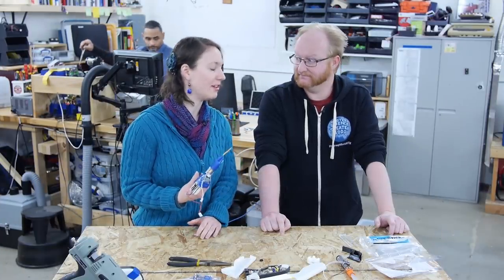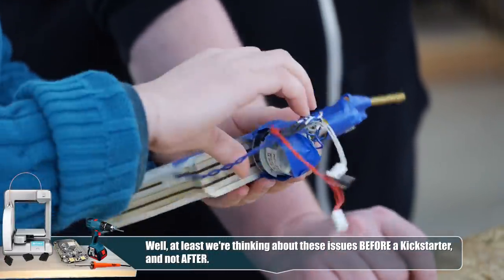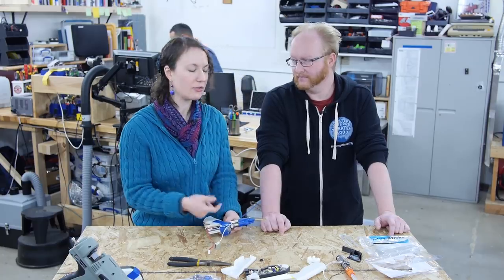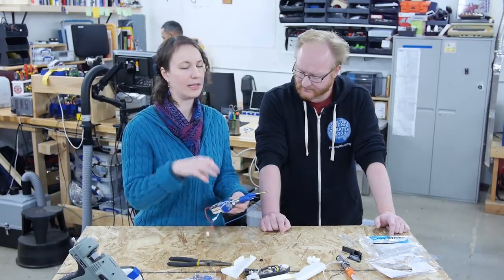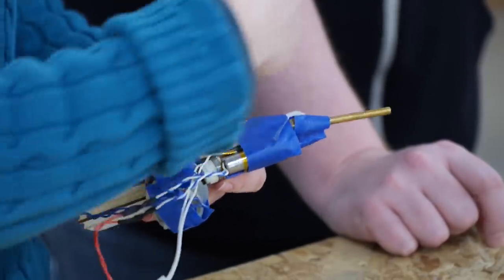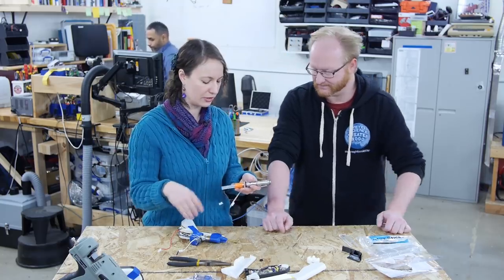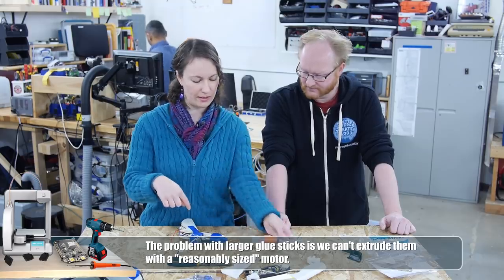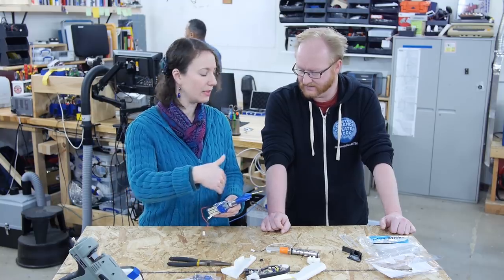Given these suggestions from our community members, I have a proposed design change that could hopefully fix some of our issues. We had moved the motor from being sideways to down into the handle to try to make the design more compact. But it was getting in the way of the trigger and also in the way of the stand. And it was too far away from the heating element, so we would have issues with the anti-drip function - too often the stick would be disengaged from the gear. If we cut this feed barrel down to as small as possible and then got the motor's gear as close to that as possible, we would have the biggest percentage of active time where the melted glue stick is engaged with the gear.